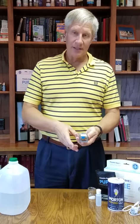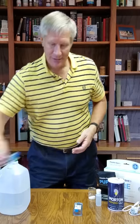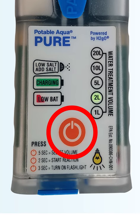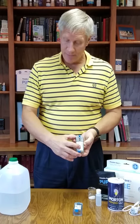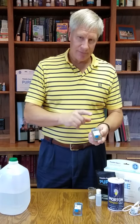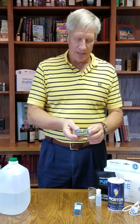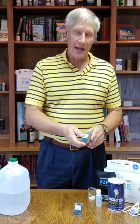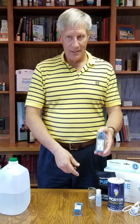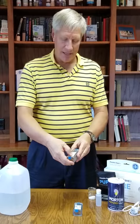The next thing to do is to select how much water you're going to treat. If I press this button, it shows me the options of liters or quarts of water that I can treat. I'm going to treat about two liters of water — press it a second time. Then once I have brine in here and press and hold the button, it will initiate the electrolytic operation to make the mixed oxidant. If I did not put in sufficient salt and I command it, it puts on an alert that says 'no salt or low salt.'